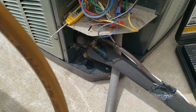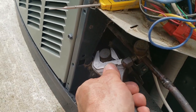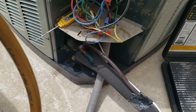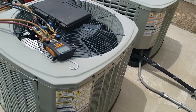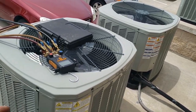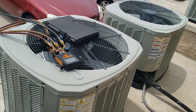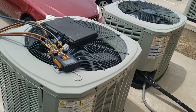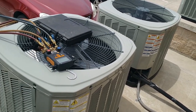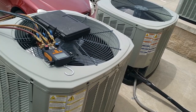I'll also check the caps on the unit itself — that one's a little bit loose, got them both tightened. When you've got something random going on and you're trying to narrow it down, I'll often come out with the manager and show them where the units are located so they know which ones to monitor. I'll ask: was the fan running, did the unit feel like it was running, was it blowing on the inside? The more information you can get, the better you can build your case. Everything is detective work, especially when it's not cut and dry.